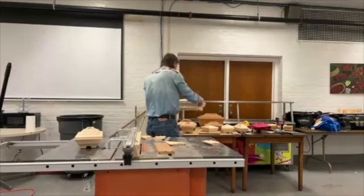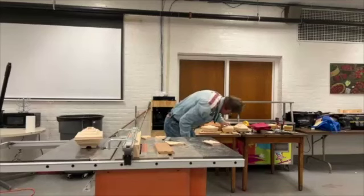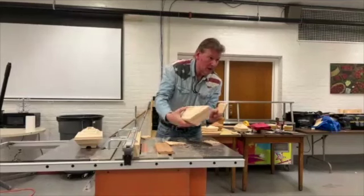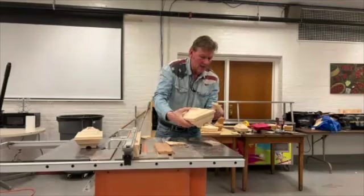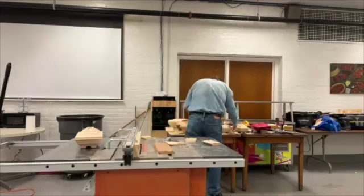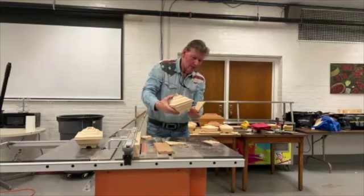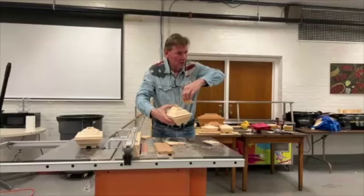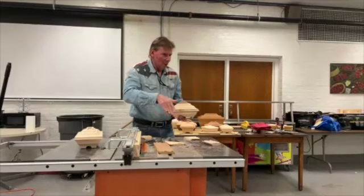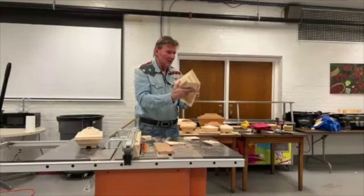And like I say, you reverse a lot of them. There's one that's reversed. This one's reversed. You see on the bottom, this part of the molding is down. And on the top, oh, I did not reverse this. Hang on. This one is the same. Here we go. On this one, it's reversed. That's why this one's so domed. And then reversed it up on top on this one. But again, I sat this angle in the initial setup almost the same way it would be on a ceiling. I went to the maximum height, which gave me almost a flat top.